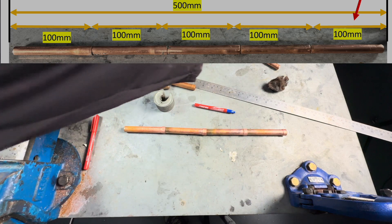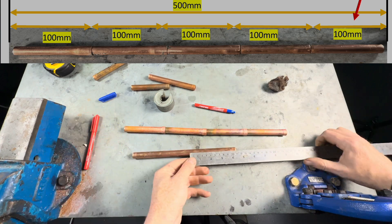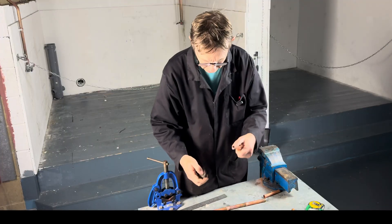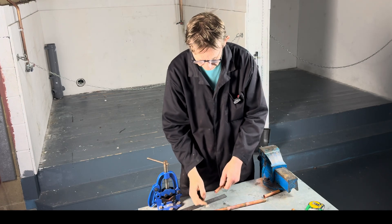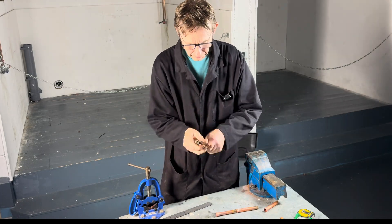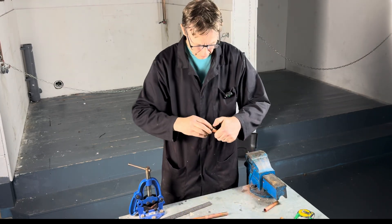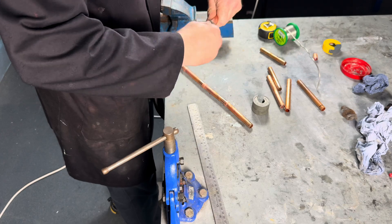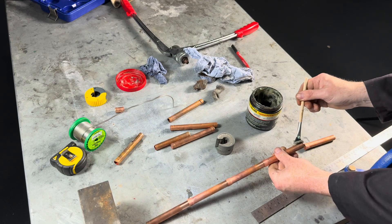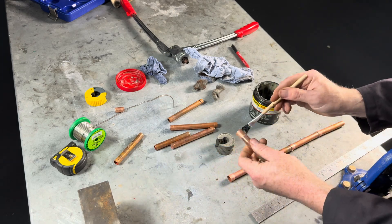So the pipe that we didn't expand, we just need to measure 110mm. The pipe that's going to be soldered — where we solder we need to clean the inside and the outside of each join. Flux each join — one, two, three, four.